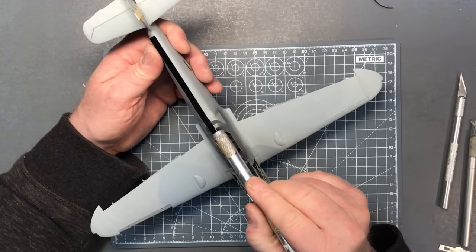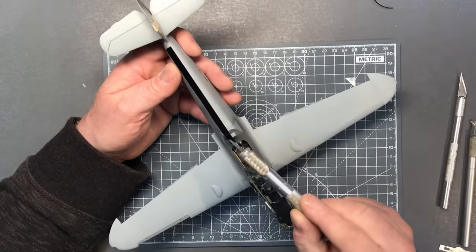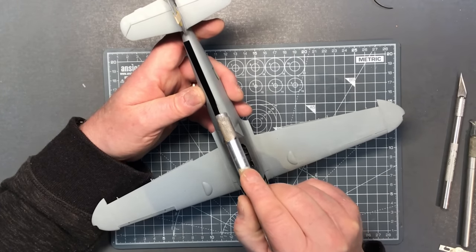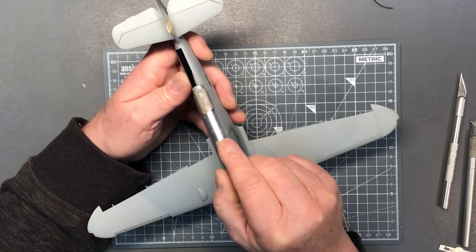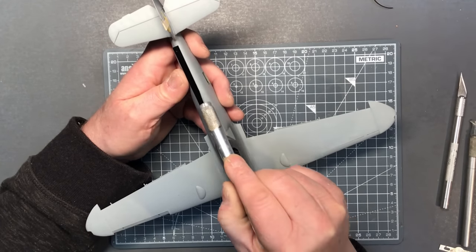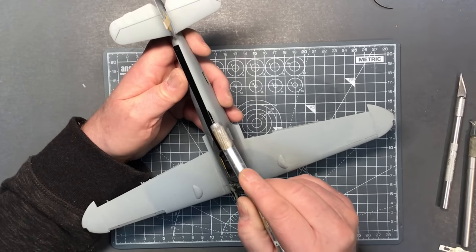along, and this is just a case of working along very gently. And the advantage of using a saw blade with this upward turn on it is that it just follows the tape a little bit easier. And I'm hardly using any pressure on that at all. I don't want to dislodge the tape, and I don't want to cut too deeply into the plastic. It's just to start to get the beginnings of that line. So I'm pushing slightly into the tape, so from right to left. That just keeps the blade on track,